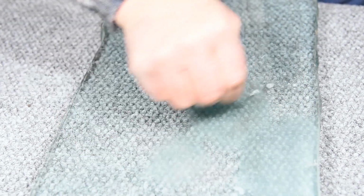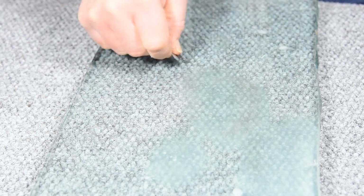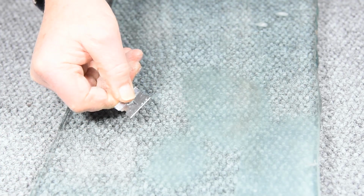So now let's get on to the lapping. What I have here is a 3/4 inch thick piece of float glass. I'm just cleaning it and scraping with a razor blade, trying to get any asperities. Thank you, Robin Renzetti, for that term. Anyway, trying to get anything off of there that might interfere with the flatness of the plate. And I'll clean this off a few times.